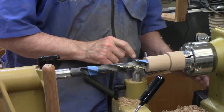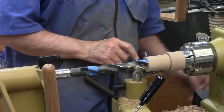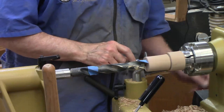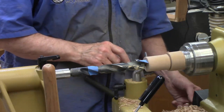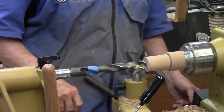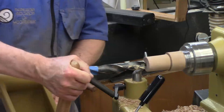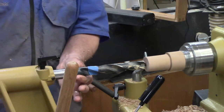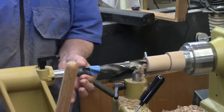This is using the lowest torque setting with the speed from 60 to 3600, and let's hope that doesn't balk so I don't have to take the time to change the belt. We're going to slow down to a little under 500, lock the tool rest down, and just drill until we almost get to the three-inch mark.